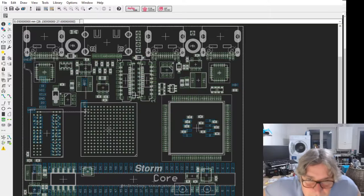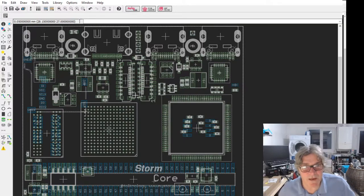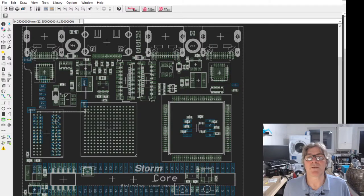So I've removed anything extraneous. Anything else you want to do will really be done through this set of ports here, which connect to the expansion board. This is the same sort of dimensions as the Black Edge connector, only it's 80 pins rather than 50 pins. On the Black Edge you had two either side, 50 pins. On here you've just got one 80 pin, which is two rows of 40. And then you've also got some supporting mounting holes here as well, because you need to mount that at the front so it's mechanically stable.